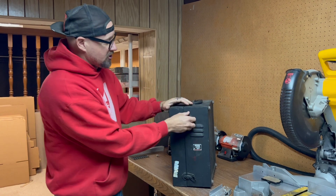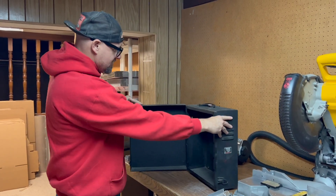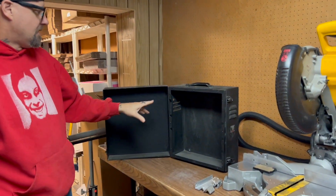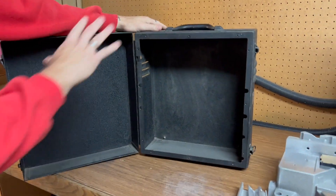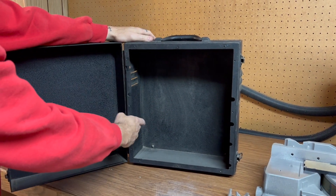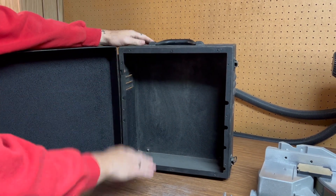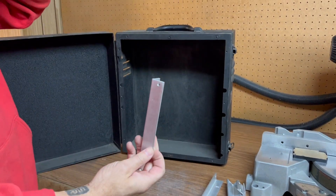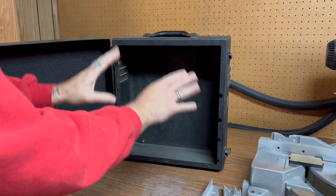You can find similar deals like that if you're looking around thrift stores. This thing's metal and it opens up like this. This case is a little bit unique and a little bit challenging for being a DIY case. What you could do is use our internal case brackets, measure across, and then minus the thickness of our internal case bracket material, figure out the length, drill some holes, and do that.